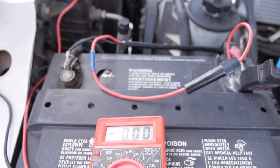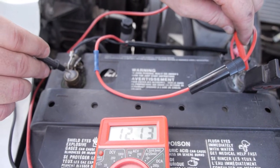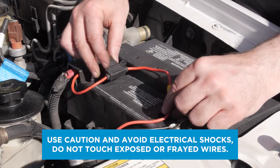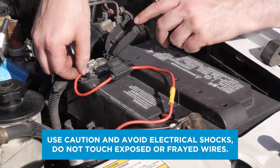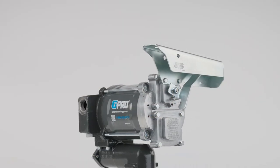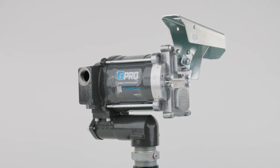You should also ensure your pump is receiving electrical power by checking for blown fuses or tripped circuit breakers. Power wires should be carefully inspected for shorts or breaks and verified to have a good connection to your battery. If you have an AC fuel pump, have a licensed electrician inspect power wiring.